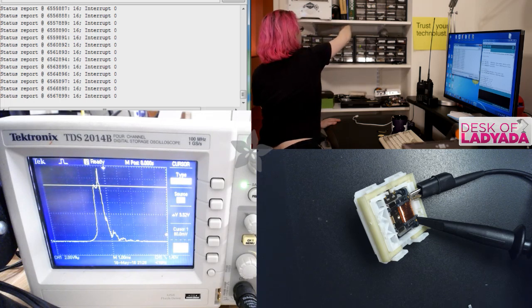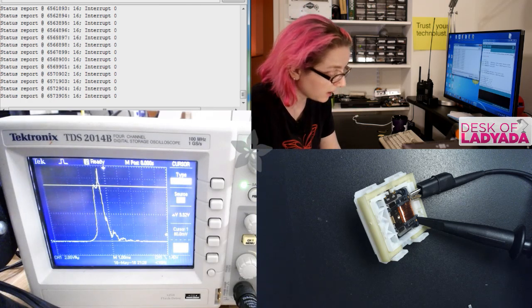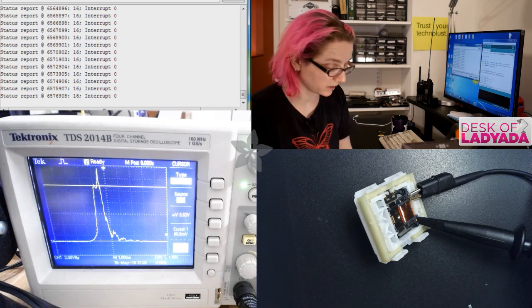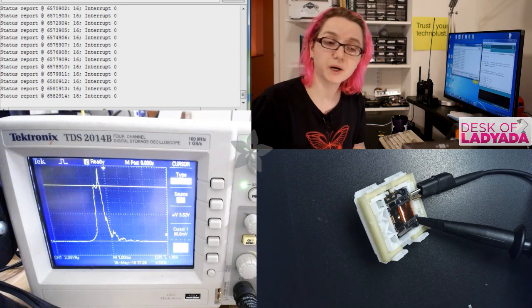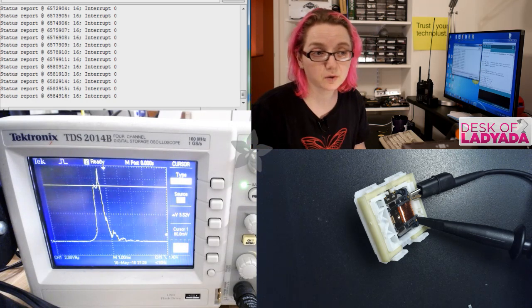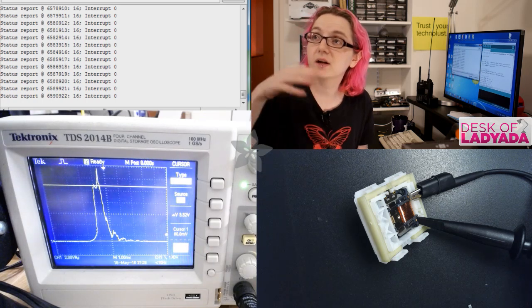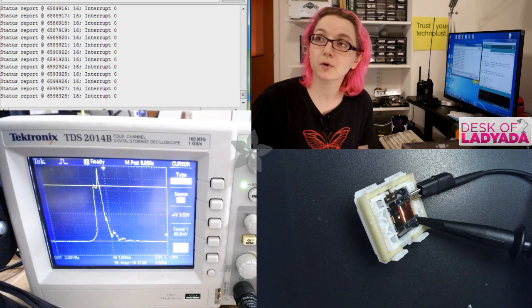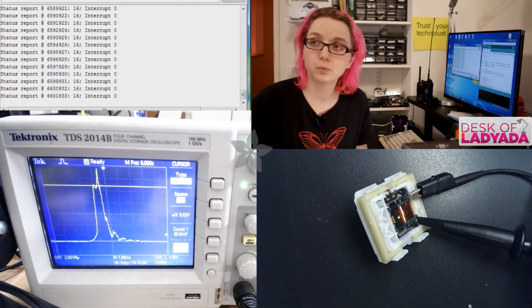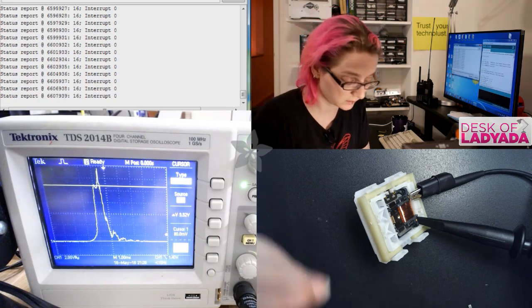Let's try loading it - I've got a 4.7K resistor. Even with a 4.7K load, it only dropped to maybe 9 volts, still about a millisecond. Let's put 560 ohms on it. That did reduce the voltage a little bit to about 8 volts. So it does drop a little bit, but still we're talking about a pretty significant amount of energy being generated.